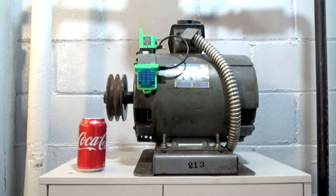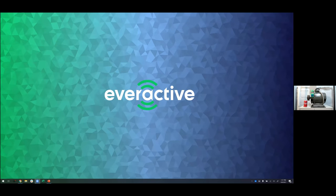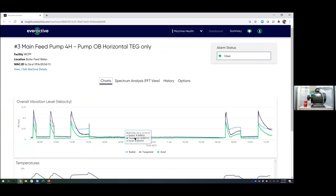I'm going to put our slideshow back on and show you what happens to that data once it leaves the sensor. It goes through our standard-looking IoT gateway, and then hits the cloud where we can visualize it. In this view, every individual measurement is shown — each of these color bars is a chart with the overall vibration level in IPS peak of that triaxial accelerometer. Here's an example of a motor with some peaks on it that's running rough. You can see we can hover over each individual one down to the minute to see what's happening. If you were spot-checking this motor, you'd have to be there at very specific times with your accelerometer to figure out what's going on. Likewise, if you had a battery-powered sensor that only phones in a couple times an hour, you wouldn't have nearly as complete a picture of when it's peaking out and how rough it's running.